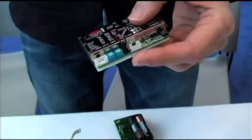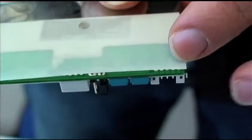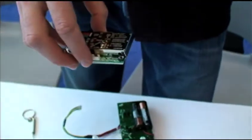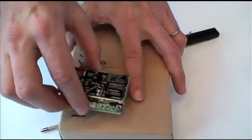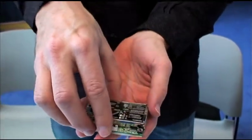So one more thing I wanted to show with the Innofader, just to make it foolproof: one thing we're doing on not just the PNP but also the Pro in the future is that we're putting an insulator card on the back. Before we had issues when people were testing the fader. Let's say you had a mixer over here and you put the fader on the mixer, the problem is the mixer's metal, and if you connect metal to metal, you might short something out. So this will make sure that you don't short anything out. Our original goal with the Innofader was to make sure it's compatible with as many mixers as possible. But we found out from customer feedback and from all the various glitches that go on when people install it that sometimes they get short outs. So we were trying to make it easier to install and more foolproof, basically.